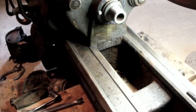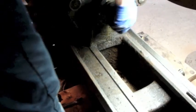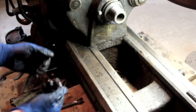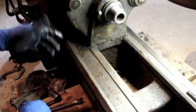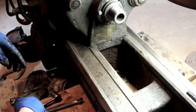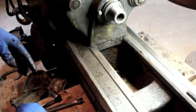I believe those are the only bolts that actually hold the headstock onto the bed. So now I should be able to just lift this right up and pull it off. Son of a gun — I was joking, I didn't think I'd actually be able to move that at all. It is obviously too heavy for me to pick up. But that's a good sign I'm on the right track as far as how this comes off. Now we're going to talk about how we're going to rig the top of this and hook onto it in a manner that's safe to lift without breaking anything.